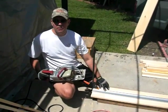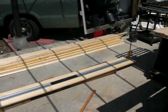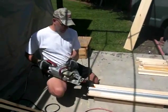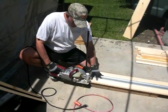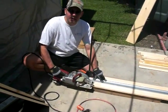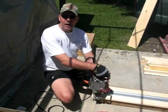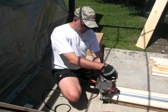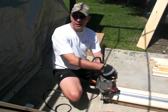It actually breaks into two 48 inch sections and has a little piece in the middle that allows you to snap it together. And what this is, is just what it says it is — a rip fence. It allows you to set your saw blade up against that rip fence and then, holding good pressure against it, allows you to make a really nice straight clean cut. In fact, in many cases I use this for cutting plywood because a big sheet of plywood is hard to get up on a table saw, and using a rip fence method like this actually lets you make just as nice a cut as you would get on a table saw.